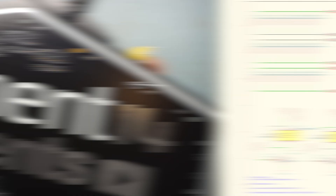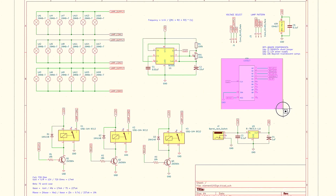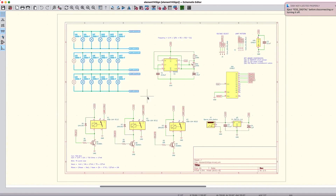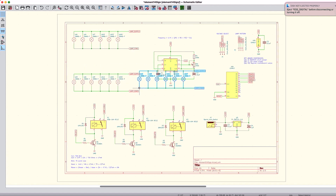Let's take a quick look at the schematic. The heart of our circuit is the 555 timer IC, which provides a pulse signal to the CD4017, which is a counter. We have a power supply here that takes 12 volts in and regulates that down to 5 volts. The 5 volts supplies both the 555 and the CD4017. To the top left, we have all three strings of our lamps that connect to the relays. Every other third lamp is in a sequence, and these are all intermingled between each other, so they operate sequentially — one string, then the other, then the other — which makes it look like a sequential pattern.